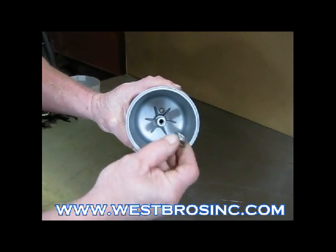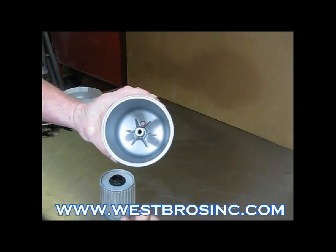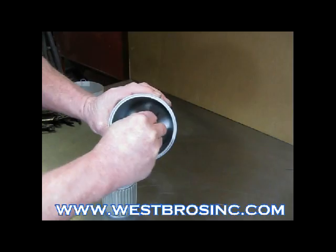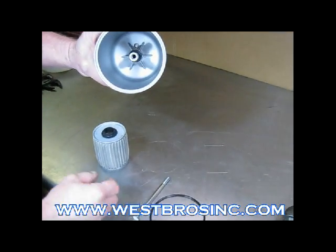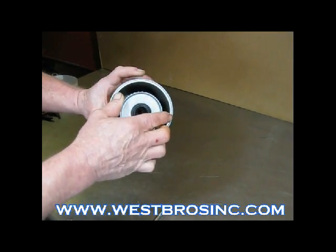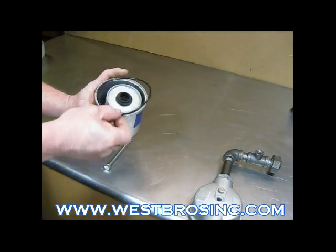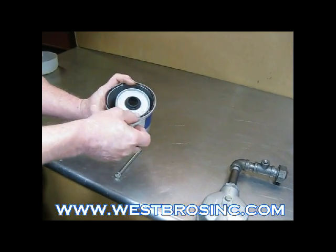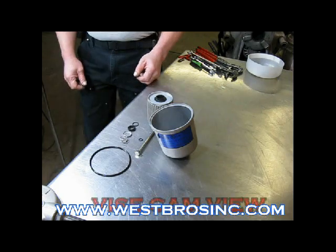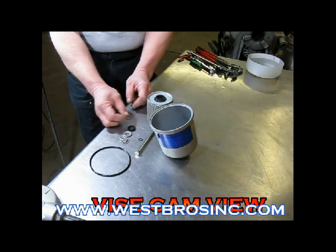This is very important. Place the spring on the retaining bolt post, then our post seal, rubber side up. Very important to have that in and correct. Place the filter on the post, touching the post seal. Be certain to get the cup O-ring in place correctly. It's very common to have it pinched or not in the cup correctly.